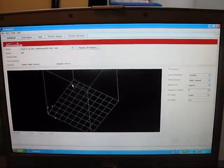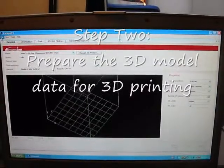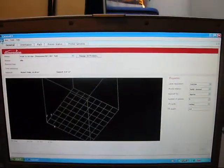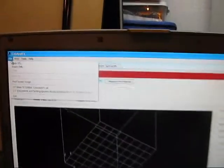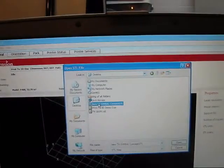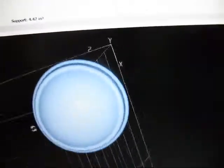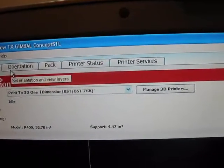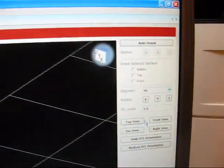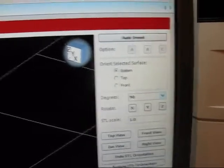I've got my Dimension Catalyst EX 3D print software opened. I'm going to import my prototype thumb knob for my radio control transmitter. I'll go to File, Open STL, Desktop, and select 'No TX Gimbal Concept.' As you can see, I just opened up the file. Now I need to go to Orientation and come over here and select Orient Bottom Surface and click the bottom.